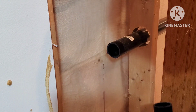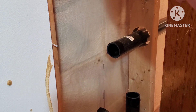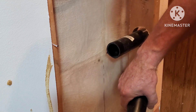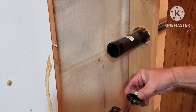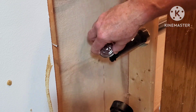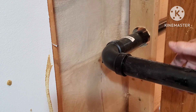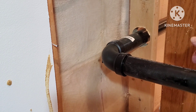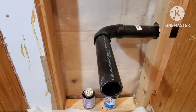I don't know exactly what's going on until the cabinet and the sink are here — I just know it's going to be in this corner. So I've got a nice long stub inside where the cabinet's going to be, so I've got plenty of room. I think most of it's going to get cut off anyway — that's why I didn't put a little six-inch level on that tailpiece. Most of it's probably going to get cut off up under the cabinet.